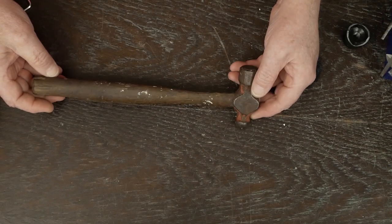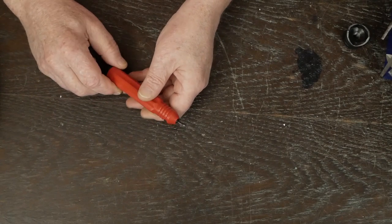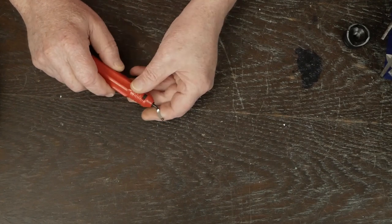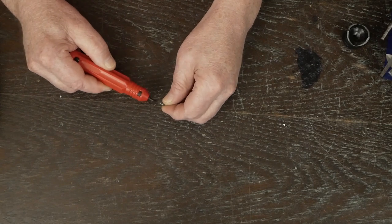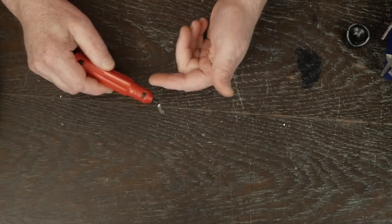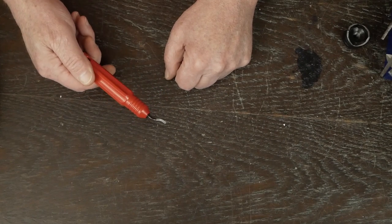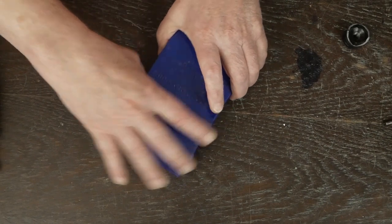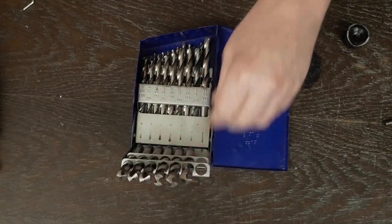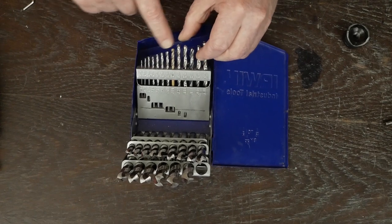Get some sort of a little hammer to work with your center punch and for straightening up metal if needed. Another really handy tool I got at the hardware store — find these in the plumbing department — is a deburring tool. This little thing spins around with a really sharp blade and works great on tube socket holes even if you use a chassis punch, cleaning up the rough edge. It's great for deburring the edges of any holes you cut out. Then you'll need some drill bits — I have a really nice metal drill bit set with an assortment of all different sizes.